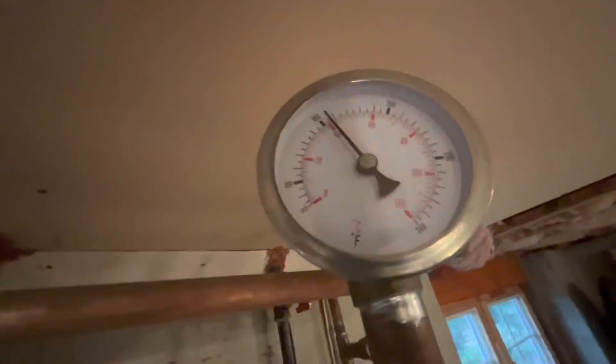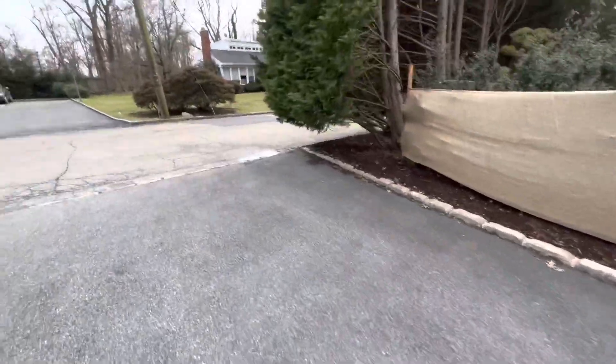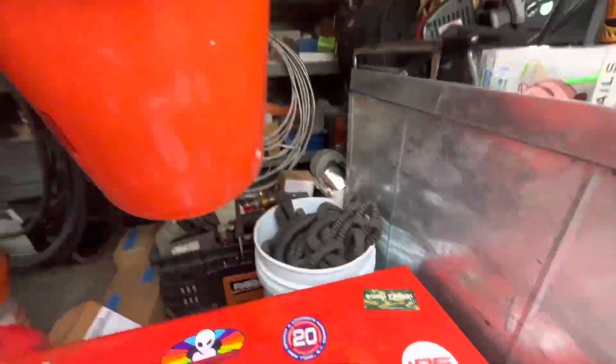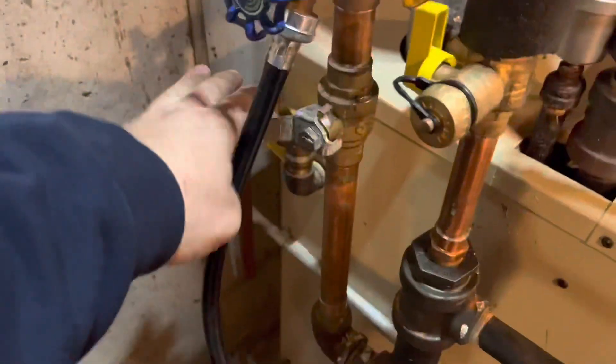She's climbing, it's getting hot. Nice, and there too — that's all we want. Purge one return on the other side, so I'm going to come and grab my bucket again. Back to the bucket. Three zones here, guys — there's radiant and two air handlers, and I just forgot to purge this zone over here. So we close this.